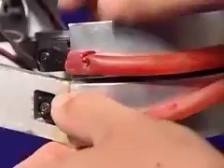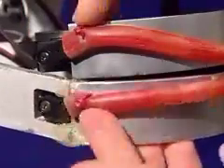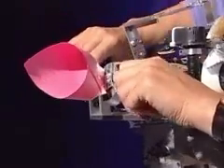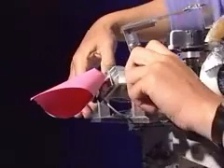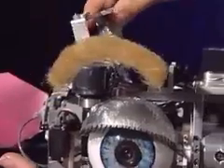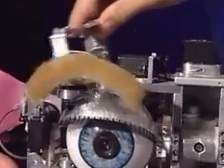There are four degrees of freedom in the robot's lips so it can curve each edge on the top lip as well as the bottom lip. There are two degrees of freedom in each ear which allow it to elevate as well as rotate and fold the ears back kind of like an animal. There are two degrees of freedom for each eyebrow that allow them to elevate as well as arch inward and outward. And then there's one degree of freedom in each eyelid that allows them to open and close so the robot can wink and blink and so forth.